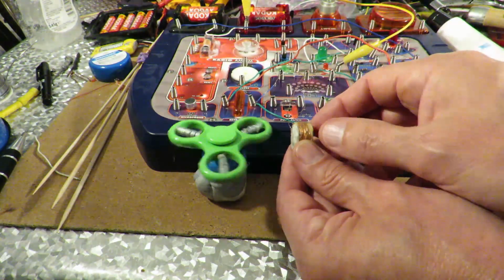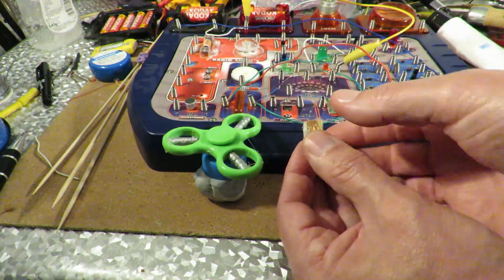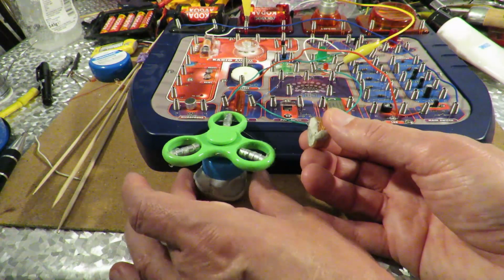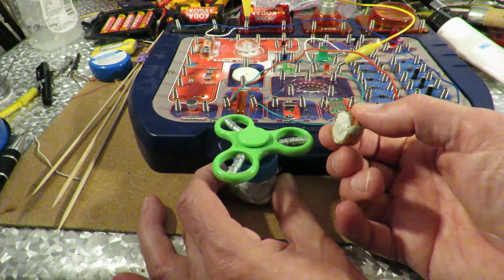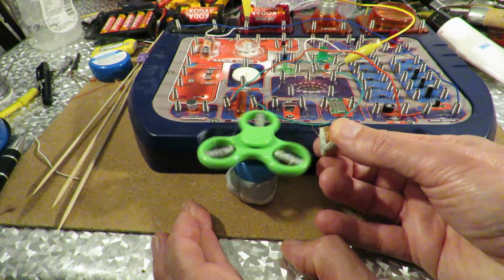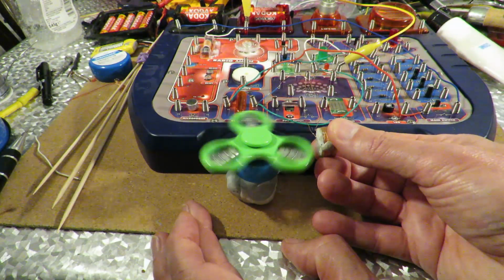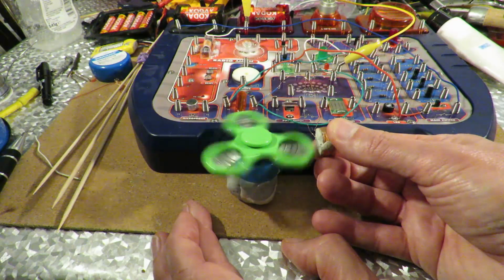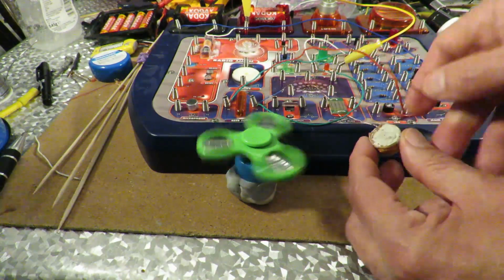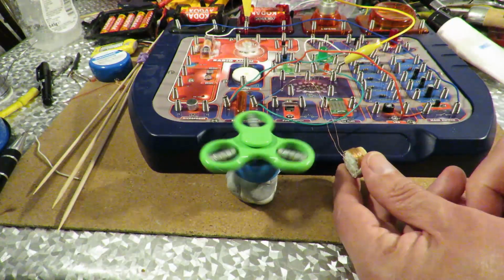Get the position just right. I've actually made myself a bit short on the wires here. Still, we saw it was working this way round, didn't we? If we move this in relation to that switch, there we go. Let's change the timing. So we're now in repulsion mode. It will work without the LED and without the extra diode, but you just might kill your reed switch.